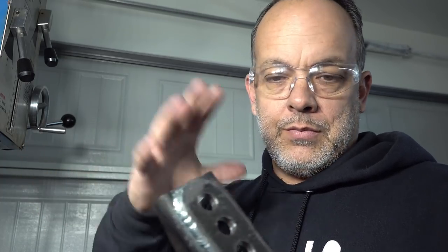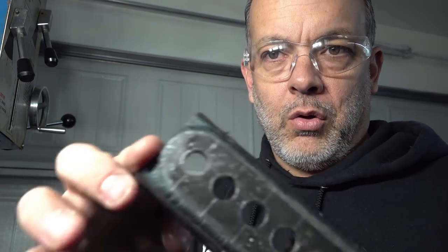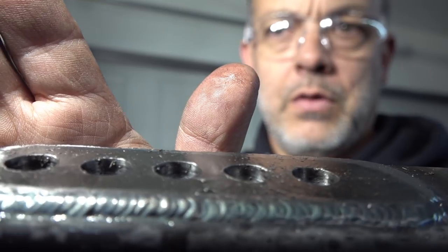The other part I was going to show everybody is the quality of the holes. Some of you guys have seen the drill bit sharpening video and some of the comments on there are just, well, self-explanatory. But I wanted to show you that is a hand-sharpened drill. You saw how fast I drilled it. The quality of the hole is what I wanted you to look at now. The holes are perfect. I didn't measure them — this isn't going on the space shuttle and the tolerance is not that critical. Anyways, we're going to drill this other shock bracket and get that thing installed in the rear end and in the car.